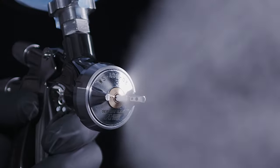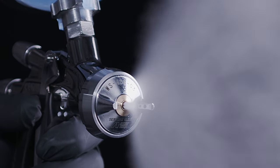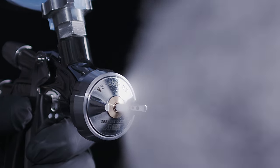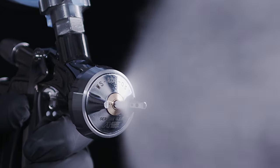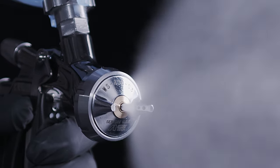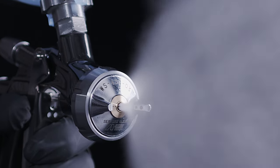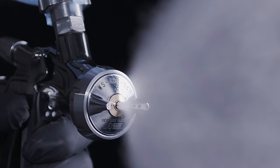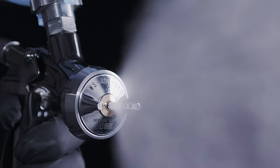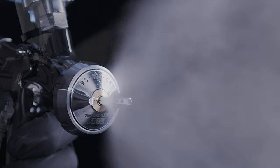As the air is introduced into the center of the paint stream, you can see how the atomization and the droplet are very fine and consistent. As the air moves into the splits and serrations, this helps us control the atomization, the droplet, and the dispersal of those droplets — we can control how close or far apart they are, their size, and how wet they are, giving a true balance of airflow.